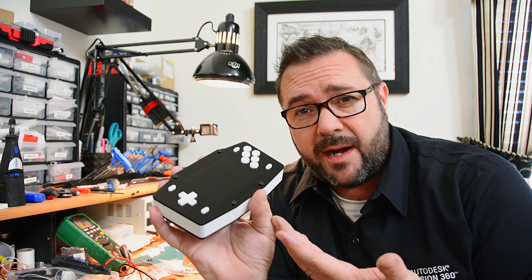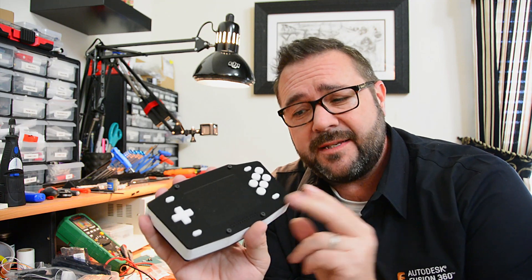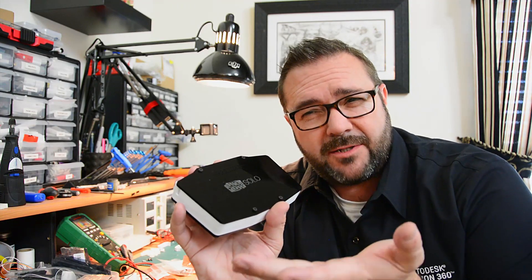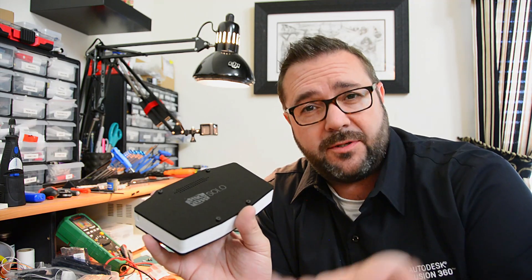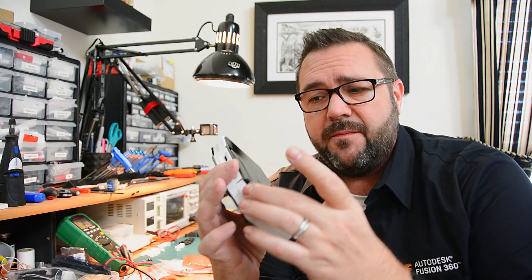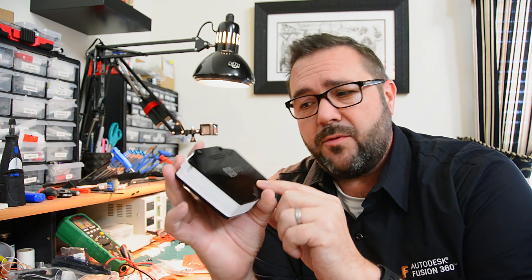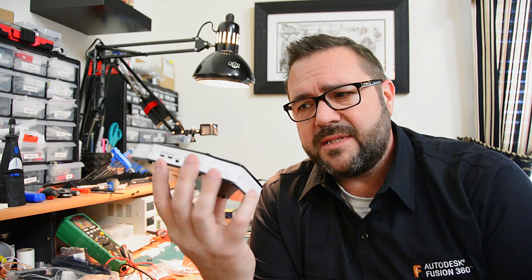That's all there is to it. Aside from soldering the wires to the Raspberry Pi, it's a breeze to install. You just install the controls on the front acrylic interface, drop those momentary switches into the sockets of the main unibody, flip it over, and mount all of your standard Adafruit electronics on the standoffs, then wire up the remaining components to the Raspberry Pi. Once you do that, it's just a matter of programming the Raspberry Pi, installing RetroPie, Emulation Station, or whatever system you use. We've also got ventilation around the Raspberry Pi to improve thermal dynamics, a laser engraved logo — the Arcader Solo — and the speaker aligned to the front speaker grill so all audio comes out really nice. Shoulder buttons and 10 buttons on the front — cheap and available.